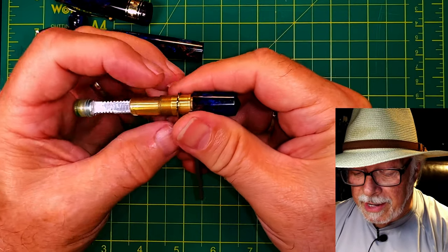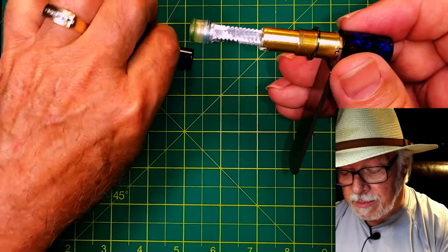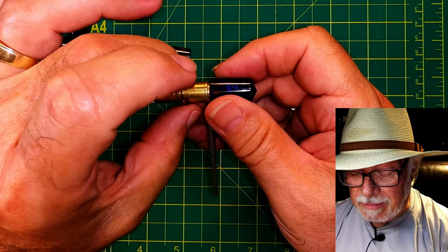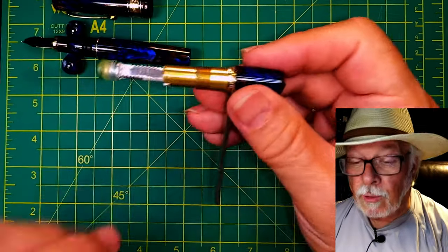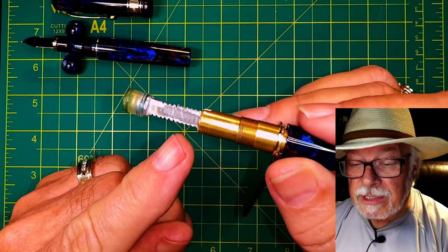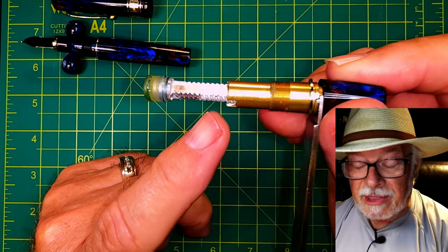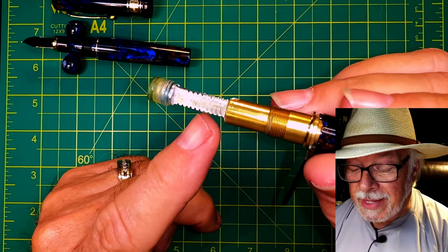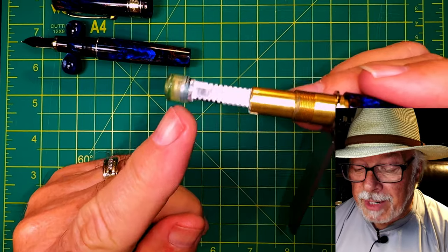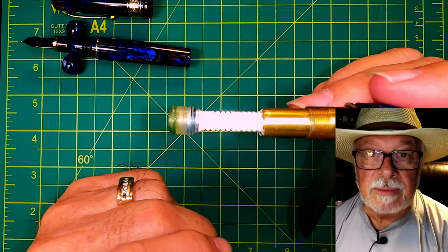One important thing: this ring is not attached to the bottom of the barrel, so do not lose it. Try to leave it right on the piston so it goes right back on. You'll see the piston mechanism and this threaded rod has some white material on it — I believe that is lithium grease. Do not wipe that off; it's very important to keep this thing lubricated. The piston itself should also be lubricated with silicone grease.